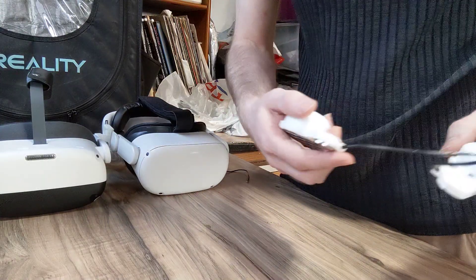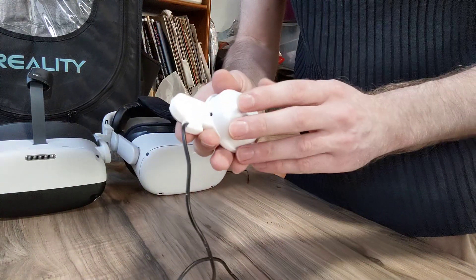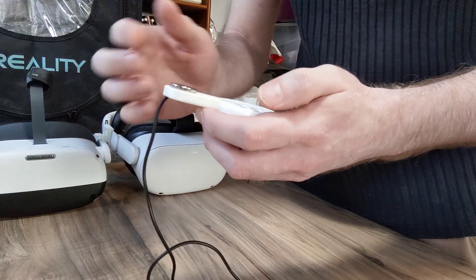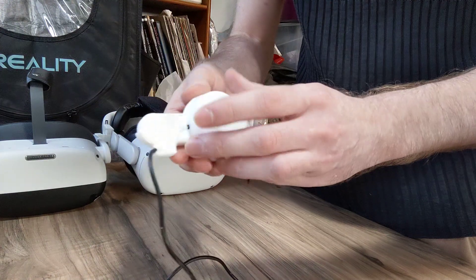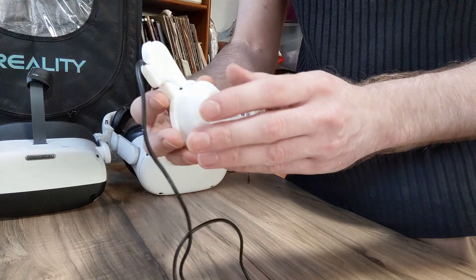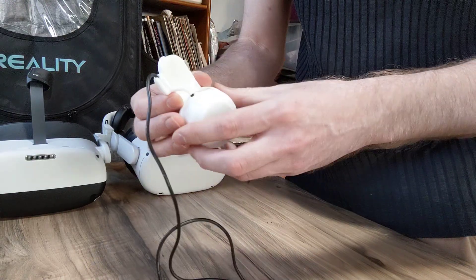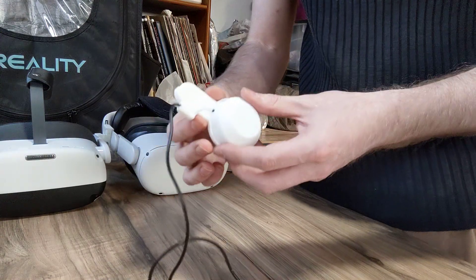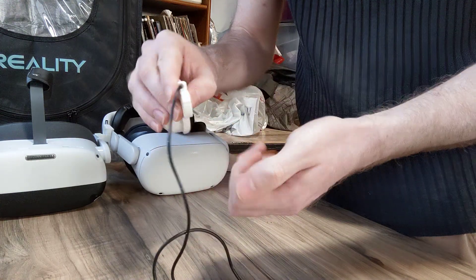This is v2 — I'm on v3 now — so I'll explain why I'm changing this. Working from a remix using Tinkercad, the original arm design was much longer and threaded the cable centrally, which I couldn't do with the magnets. Also, trying to remix this, the cup itself I'm not happy with because they're unbelievably easy to just pop off — I'd be adjusting it on my head and it would just pop off. I needed to change that whole assembly anyway. The arm idea itself is pretty solid.